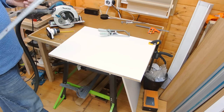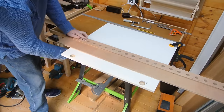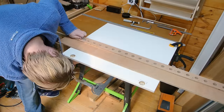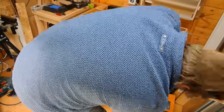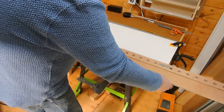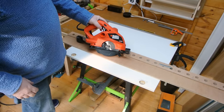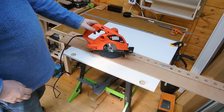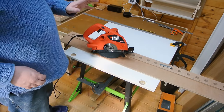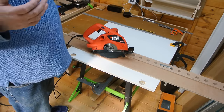I've got one more of these to do, so let's get the other saw guide out for that. Again we're using the same track clamps, lined up on the pencil marks, and it's ready to go. So here we have the competing saw — this is the Black & Decker KS40, it's got around about 45mm depth of cut. I've made dozens of cuts with this and with the fine tooth blade it does produce a very good result. It'll be interesting to see how the Makita saw cut compares using the stock Makita blade.